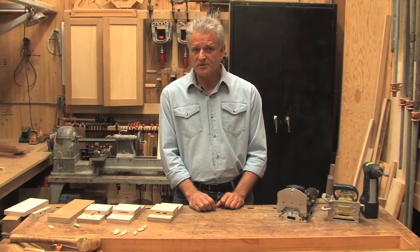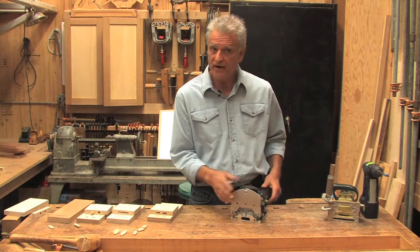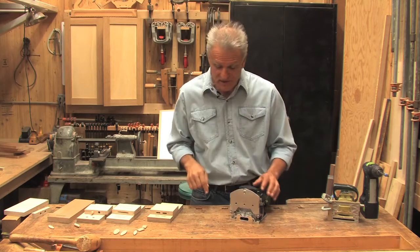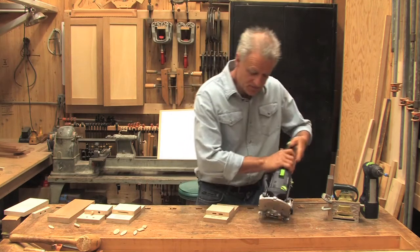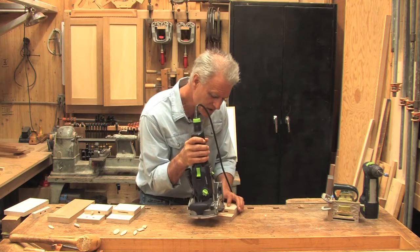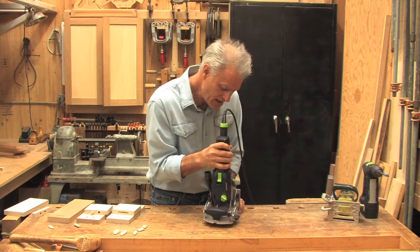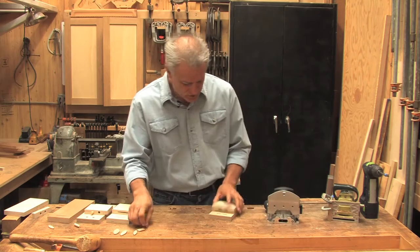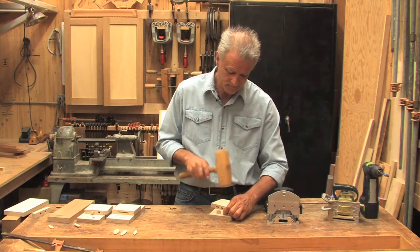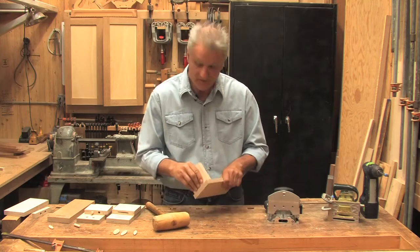Let's look at all the joinery options for this project. The Festool, which is my favorite, is a high-end, very precise joining tool, which makes a joint by having a drill bit which wiggles from side to side. It is very well suited for something like this because, as you see with these collapsible points here, this allows me to locate the tool exactly where it needs to be from either side and plunge in two dominoes, which will be very precise, very tight, and incredibly strong. You can see this one here. It's a very strong joint.